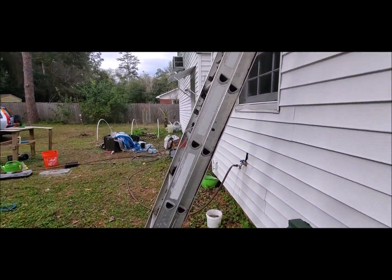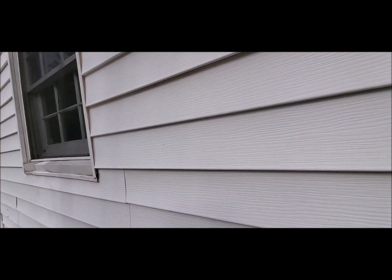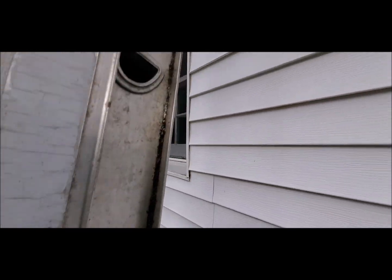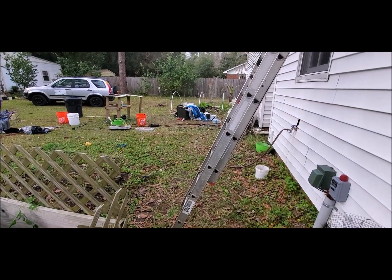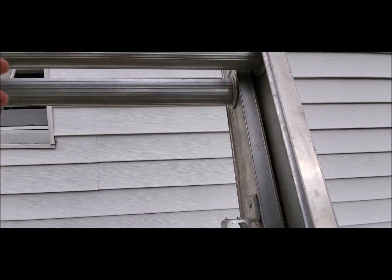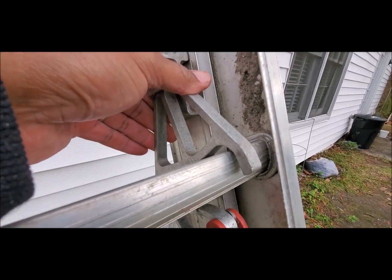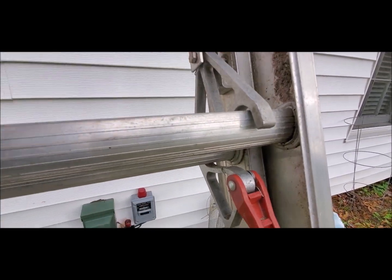If you've got a little bumps or hilly terrain, just make sure you press it in firmly. Another thing with the ladder — look at this angle. You want a slight angle; you don't want it too close up against the wall. Let me show you what you don't want: you don't want it vertical, straight up like that. You want a slight incline. Make sure this extension is firmly secured — it locks and keeps it from sliding up and down on both sides.